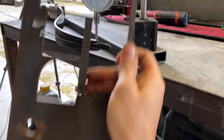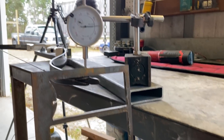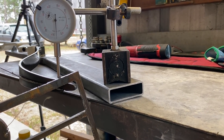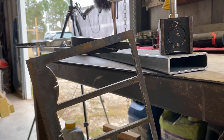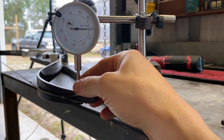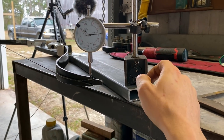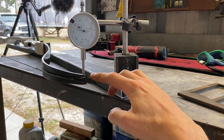I've got a weight here — it's just a piece of quarter plate scrap from my plasma cutter, I have no idea how much it weighs. If I hook it on the limb tip and watch... 273 thousandths of deflection. You can see that limb cranks crooked with that weight on it. I haven't figured out yet if I'm going to start and end at zero, but the ball moved as the limb deflected. I might 3D print some sort of flat cap to solve that. This is what I'm going to be working with to measure the torsional stability of limbs.